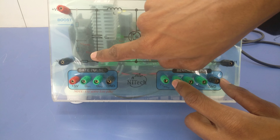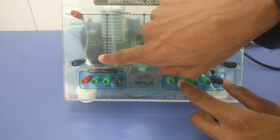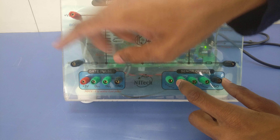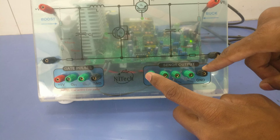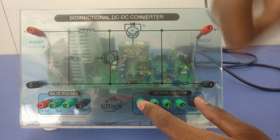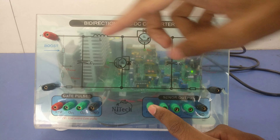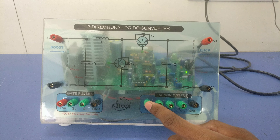My I2 current — which is the input current for boost mode — is calibrated at 8 amperes. Whenever 8 amperes flow at the input, I will get 0 to 3V at the output. This is because I have already added a 1.5V offset, so from 1.5V to 3V I get the reading whenever 8 amperes flow.